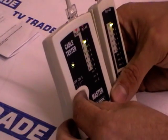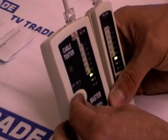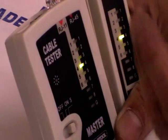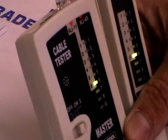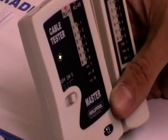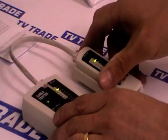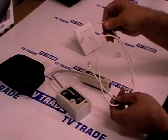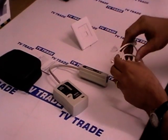Now if we are running into problems and want to analyze it further, we can slide it over to the slow mode and it goes through each pin very slowly. This is actually a very handy mode to check in because the quick mode is maybe a little bit too quick. It's exactly the same process if we were to use RJ11s for traditional phone cable — it'll simply check the four pins for us.